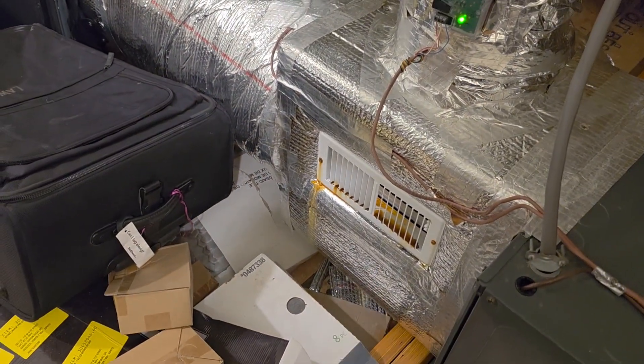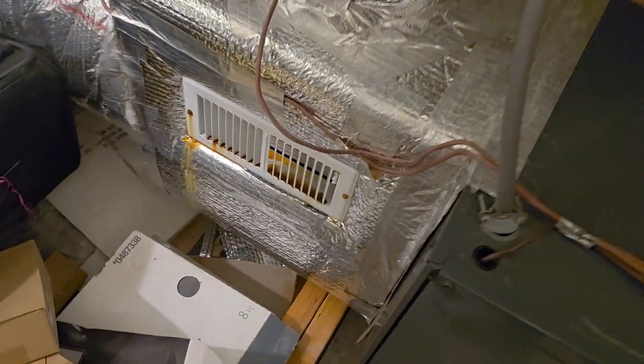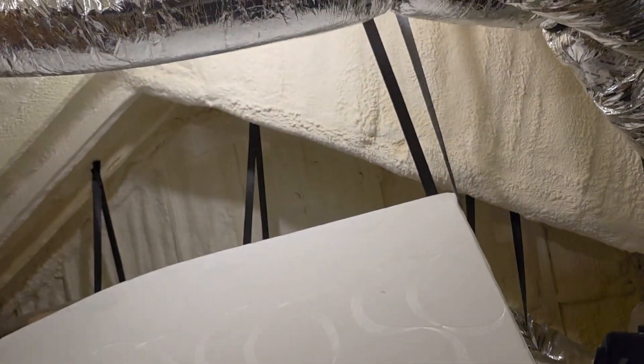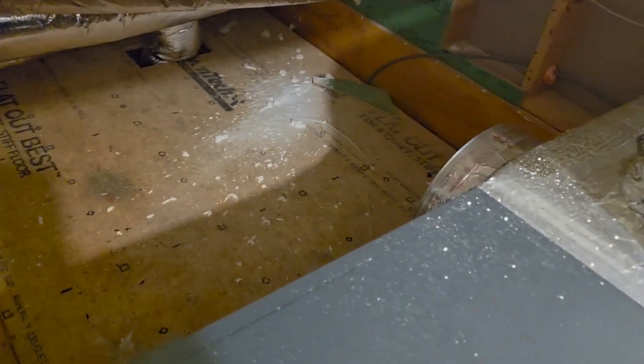I capped off the supply, capped off the return, and got to touch up some insulation there. This is an encapsulated attic, so they have a little supply vent right here — that's just barely cracked open and is the only means of conditioning this attic, so we're just going to leave that as is. The main thing I wanted to do was get rid of this bypass that was continuously bypassing the supply into the return plenum.